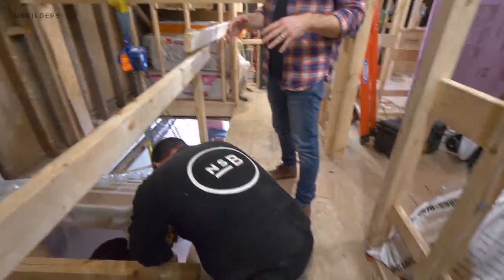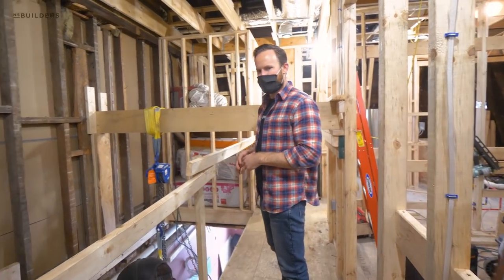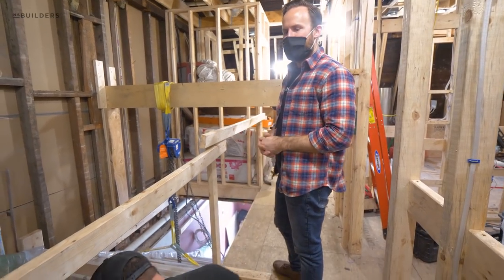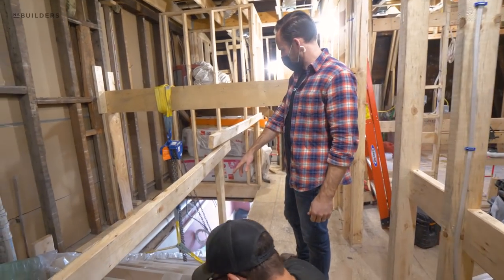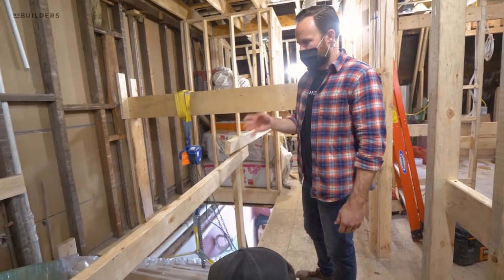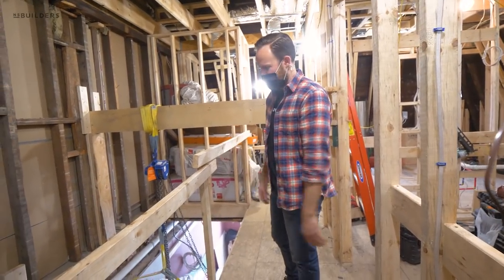That beam intersects the bottom side of the staircase and the staircase will rest on this beam in multiple spots to support the weight of the top end of the stair. Once it's in place, they'll grout that beam into the pocket in the brick wall, structurally support this end to our beam in the stair opening, then lift the staircase up, pull the temporary beams out, and drop the staircase in place. From there the straight section is supported and the guys will start fitting all the winders in the field to complete the staircase, then move on to closing the temporary access and handrail. The guys have already protected the staircase completely with temporary treads so we're not damaging the finished stairs.